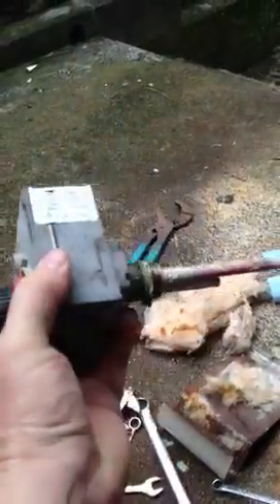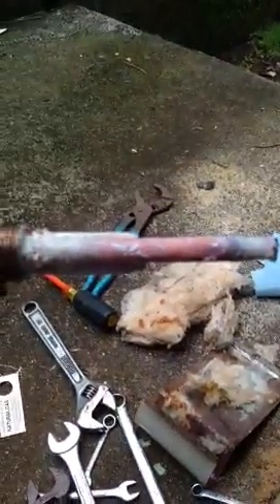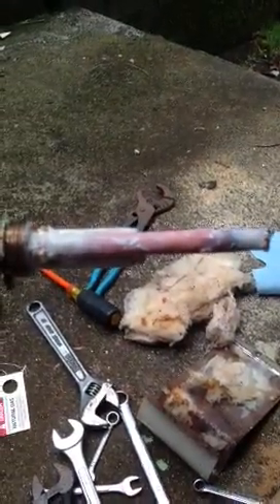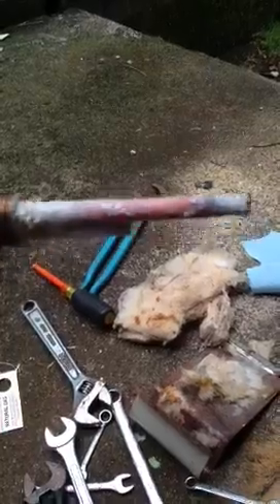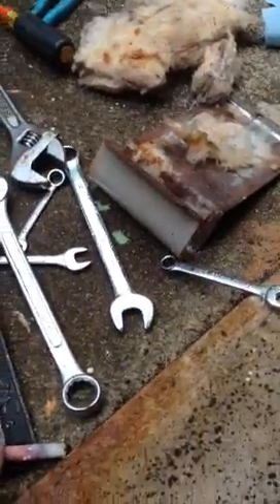As you can see, this is an older control. If you look at this probe — I'm draining it right now — what I found out was that lime was caked all on the temperature probe, so what it was doing was insulating the heat from getting to this probe. I've kind of taken some of this off with my finger.